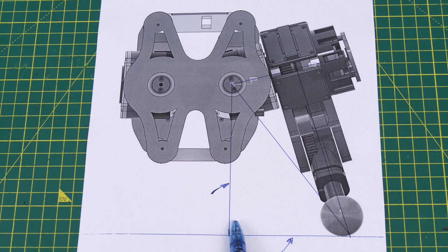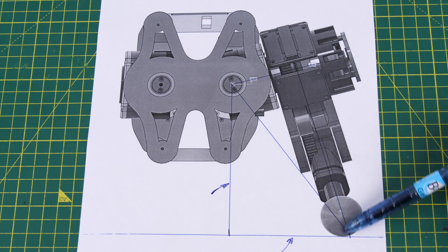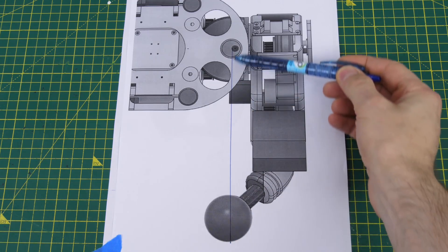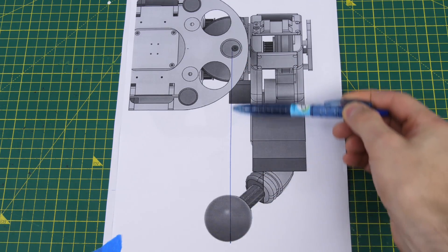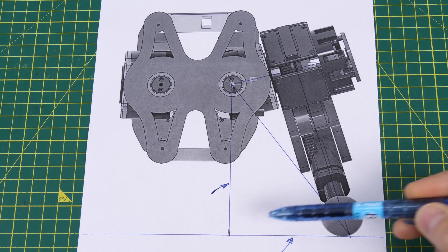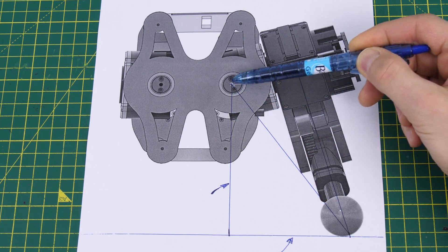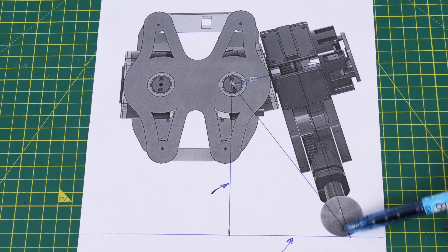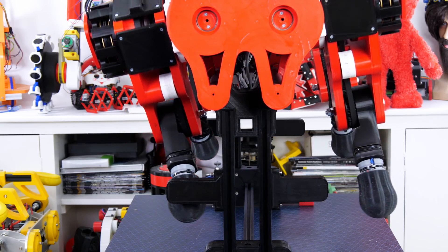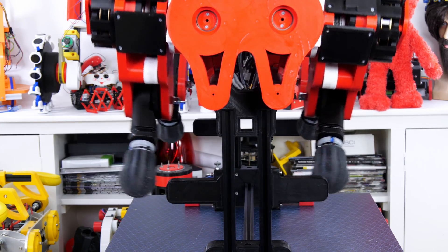After that we need to deal with the third and final translation axis which is moving side to side. This is very similar to the front-to-back translation axis, other than in this version of the dog we have an extra offset and another triangle to calculate. In Open Dog version 2 the foot was directly below the joint pivot point. In any case we can work through the triangle, setting the height we want from the ground, working out the virtual leg length and then solving the second triangle to work out the real leg length. All of this gets passed to the previous stages so all of the axes mix together and now we can move the foot around in all three translation axes.